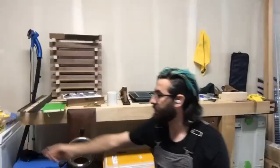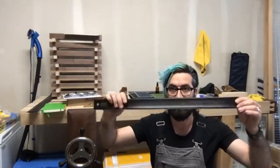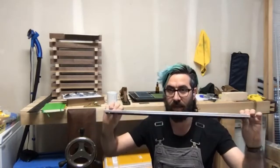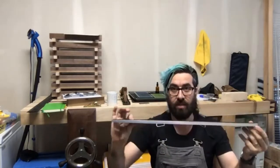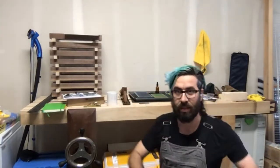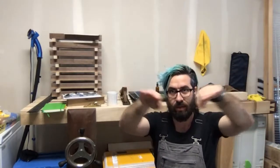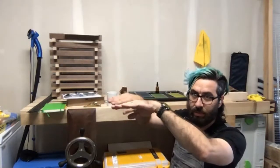That's great. I will start with something that is not related to blades, and that is straight edges. So I have here a straight edge. It is flat on one surface, right? This is a moderately expensive straight edge because this sight line is dead straight, but it's on one surface. When I got this thing back home and I was flattening the table, I got it assembled, and I ended up with a situation where the table was slanted inward like that. The front half slanted back down and the back half slanted up.